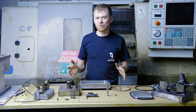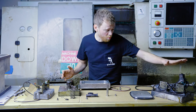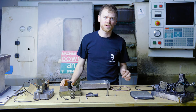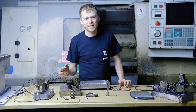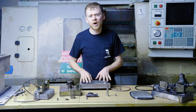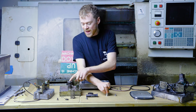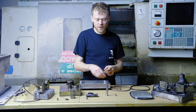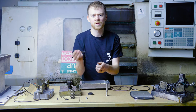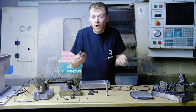A couple of things can go bad with this tool release piston. If you have dirty and sticky air and a really dirty shop environment, over time the piston will look completely black or just nasty. That won't cause a problem but it will be kind of gross. The inside of these pistons get nasty and then when it goes to clamp it won't fully unclamp, or when it goes back it will be really slow and make a farting noise. That means there's probably gunk, a bad or worn-out o-ring. I've seen snap rings fail so the spring doesn't go back up. I've seen the shafts have issues too — the threaded bolt gets unthreaded and rips the threads out, or the shaft just breaks in half, or they get worn if your machine has a couple million tool changes.